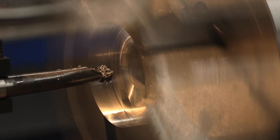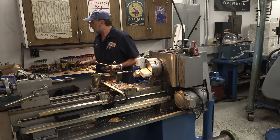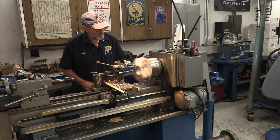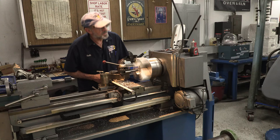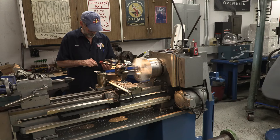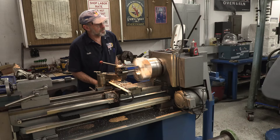That was our 3.422. The bore on the gear we're going to clean up is 1.122, 1.1223. We're going to open up that bore, or at least touch this bore in here, because when I went back to it it's like 1.184. It is larger, but I'm going to go ahead and take a little true cut in here — at least to 1.200.